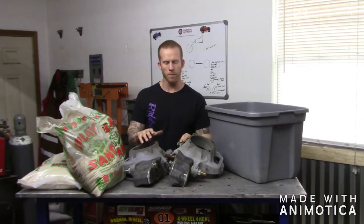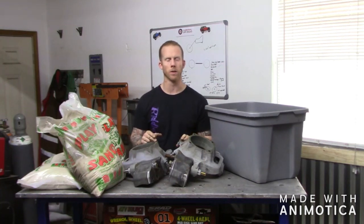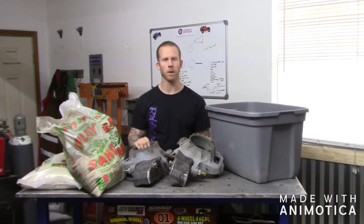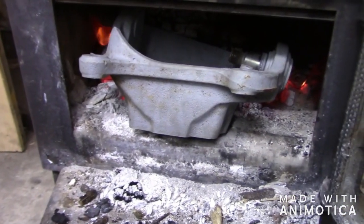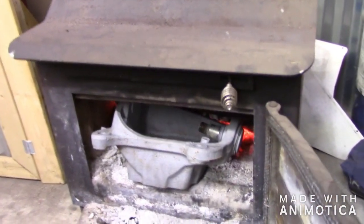I went ahead and took these knuckles off just to make it easier to weld. Now, before welding you need to figure out what kind of metal you're dealing with. The easiest way is to hit it with a grinder — if it's a dull red color it's cast iron, and if it's throwing normal yellow sparks like regular steel then it's cast steel. I'm going to preheat it to about 400 degrees, weld it, hit it with some heat again, and then cool it down slowly. You can wrap it in a fiberglass blanket and insulation, but since they're pretty small I'm going to throw them in a tub, fill it up with sand, and let it sit for the day. I had to go to plan B though — I ran out of acetylene with the torch, so I'm going to take these knuckles one by one and throw them in the fireplace for a while, then weld them after that.